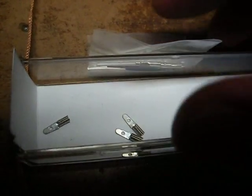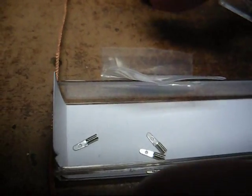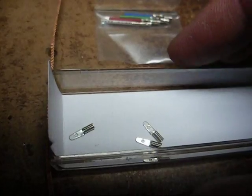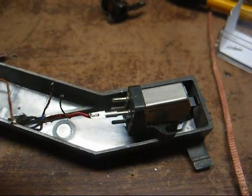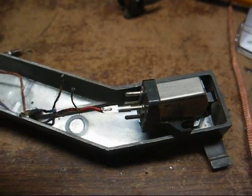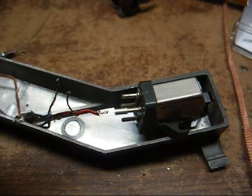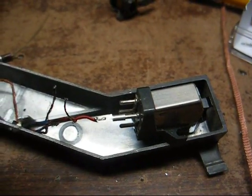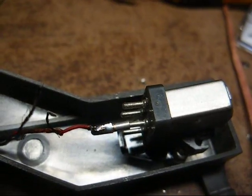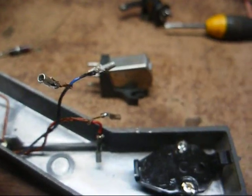This cartridge comes with four solder-on cartridge clips as well as some jumper wires for using the cartridge in a mono record player. We won't be using the jumper wires today — we'll save those for a future project. All we'll be using are the cartridge clips. When preparing these clips to solder to, it's helpful to have an old dud cartridge to slide the clips over to keep them stable while soldering, and it also helps prevent solder from filling up into the cartridge clip. Don't ever do this with your new cartridge, because heat from the soldering iron could ruin it.